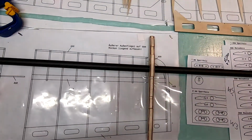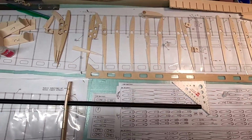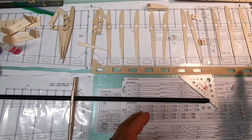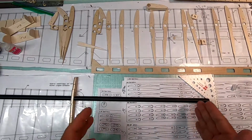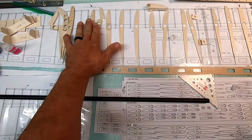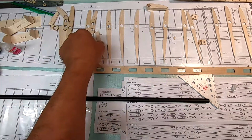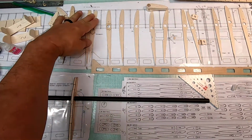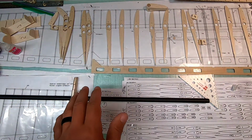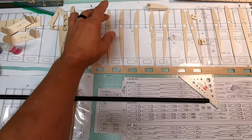Now, what I'm going to do there, pardon me while I move the camera, basically you just take the pieces one at a time, slide them on in the proper order, get them roughly positioned, and then once they're all on, with the exception of the two outer ones, which is the solid and the big hybrid, this one stays off to the side for now because that gets done later without the jig. So this one I'll glue together first, and likewise the one at the other side.